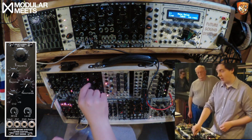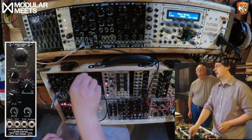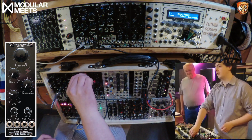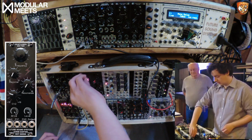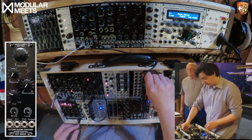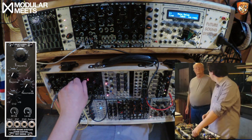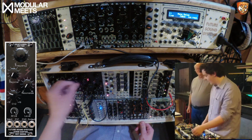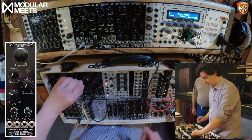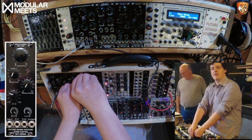We've also added resonance and register controls, so you can get the resonance to really squeal as well as you're driving it quite hard. And then the register control actually shifts around the resonant frequency of the filter core. So as Roy was saying, we've got this multi-feedback filter core. And we can shift essentially where that resonates, so we get this interesting, again, quite vocal effect out of it.